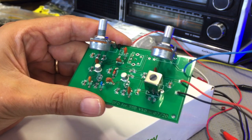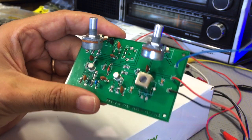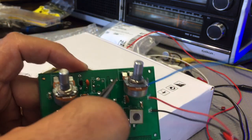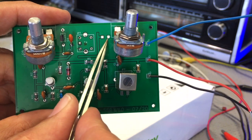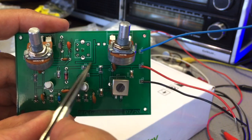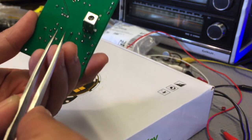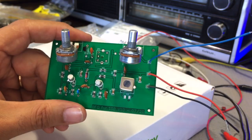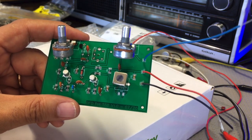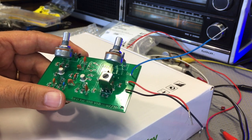There's actually one resistor missing — a 3.3K across the primary of the second IF transformer. The circuit says that's optional, so I'll leave it out for now. There's also a copper track issue here — I wanted to leave it exposed so I could add a shield, but I got that wrong. Putting a shield makes no sense anyway because the IF transformers have their own shields and they're on the underside. So let me test it again and see what happens.